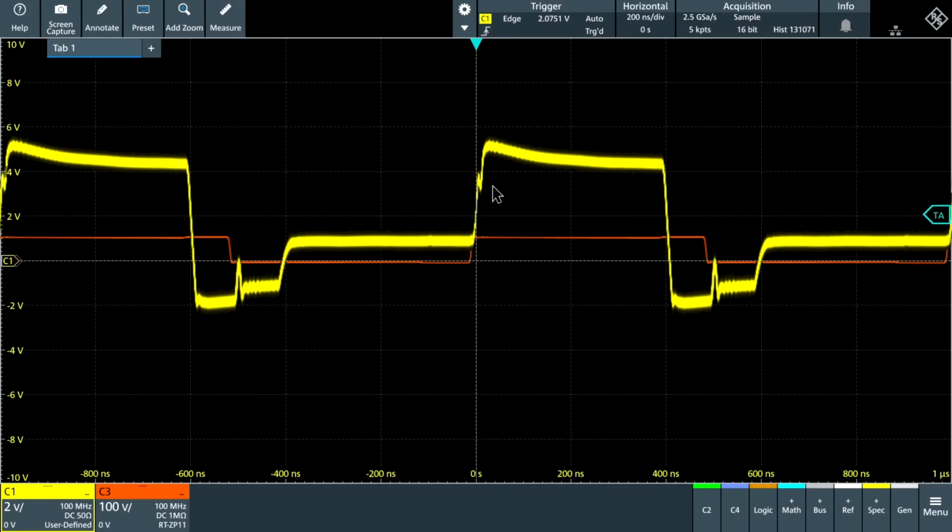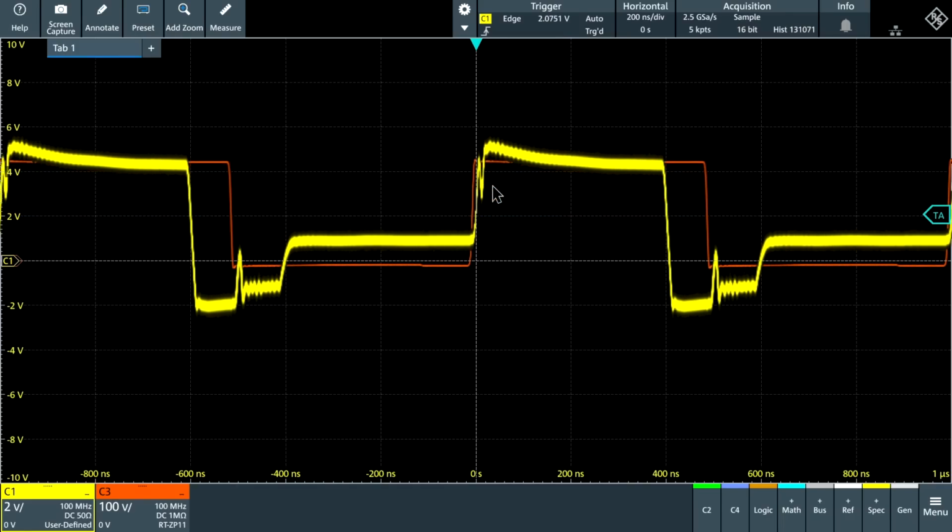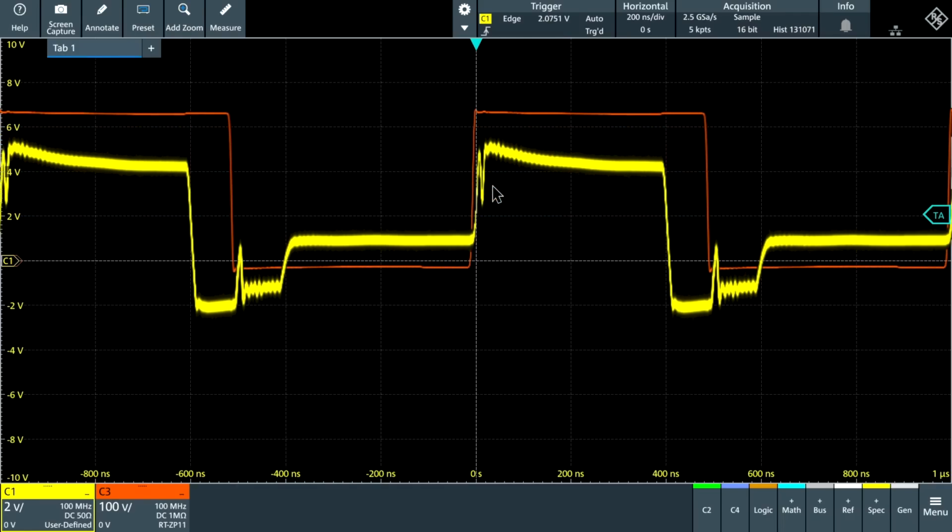If you see any changes at all in the actual measurement, we're seeing differentially. So here's 50, 60, 70, 80, and here's 100 volts. You can see absolutely no difference in the voltage that we're measuring differentially, which is quite impressive. Let's go all the way to 300 volts. Here is 310 volts, I believe. Yep. Again, no difference at all.